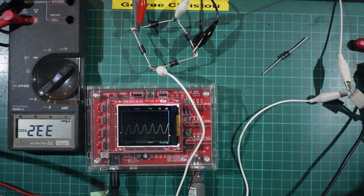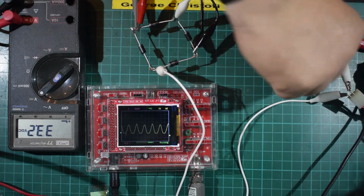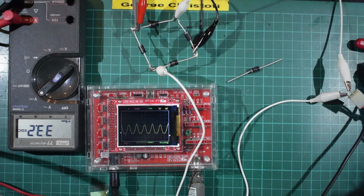It all goes down to Ohm's law and all the other bits and pieces that go with it. As I say, I'm not going to baffle you with maths, but needless to say, if you're actually looking for efficiency, you're better off using full wave rectification and getting the 90%, as opposed to with a single diode only 60-65%.